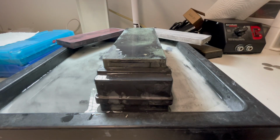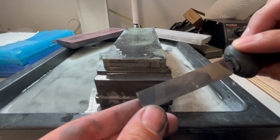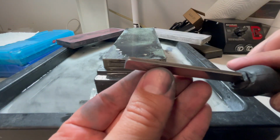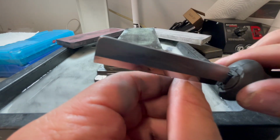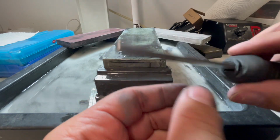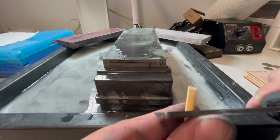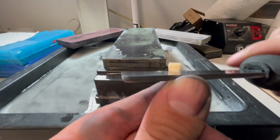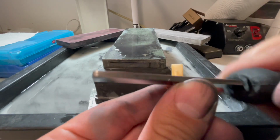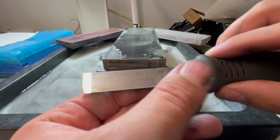And to me, it put a very nice little extra oomph on the end of the burr. And it gave just that little extra grab to kind of smooth it out. That's actually what I like to see when I'm using my double hollow grind knives. So I'm really impressed with what that did. Sorry that's not in focus. But I really like the way that burr is grabbing. I think it's nice and smooth. It's got a nice cut to it.